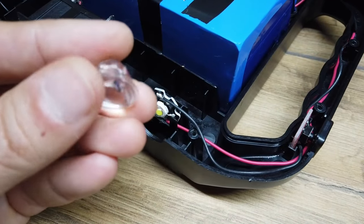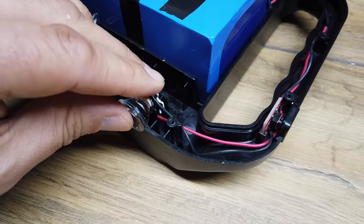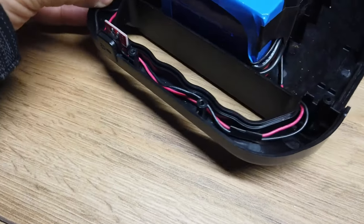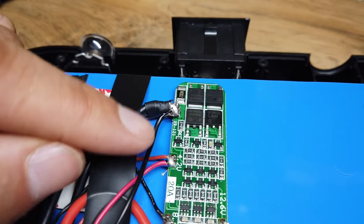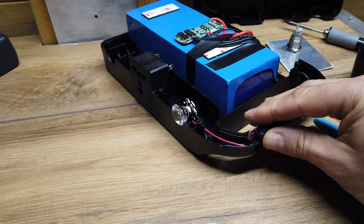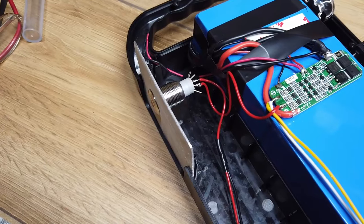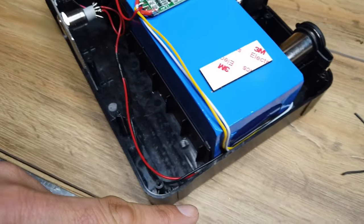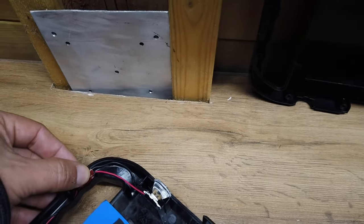It has a little heat sink on the back of it and a lovely little lens — and I didn't want that not to work, so I spent some time wiring that up. What I've done is gone through the handle switch here, which you can see working, and routed these cables into one section of the battery — the 4.2-volt section. Now we have a flat-out high-power LED torch which will last for a very long time, but it's nice to have that feature working again.